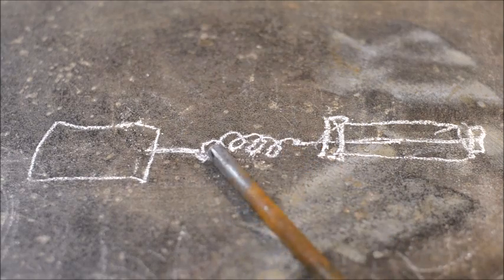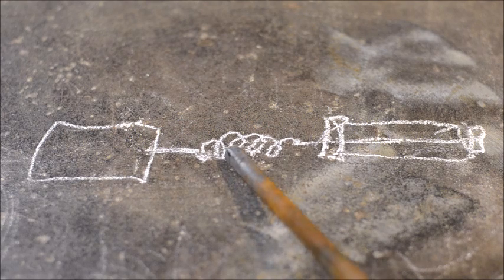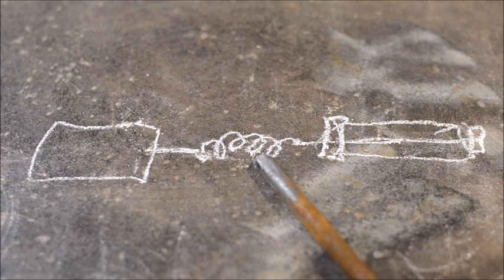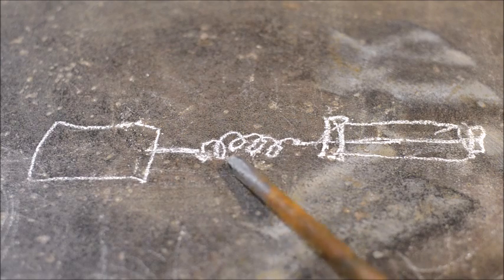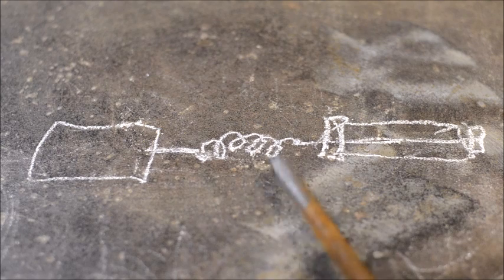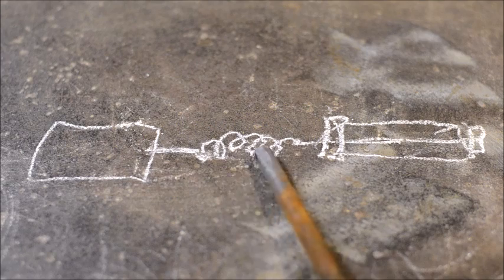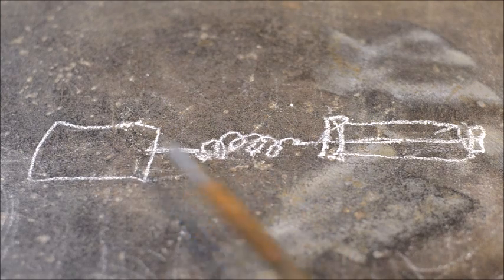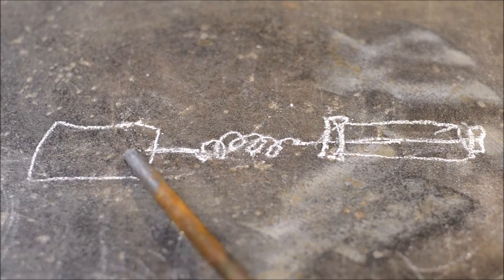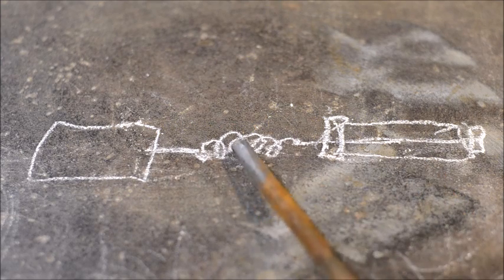I try to be as thorough an explanation as I can, and I really hope you guys get these core principles I'm laying out. There is a spring in here. This spring isn't so it can flex all about — this spring is to eat up the shock or the kinetic energy before it gets to the handle end. That's what we're going to do here.